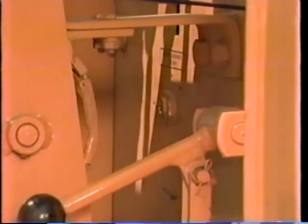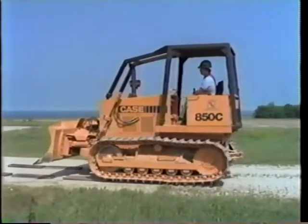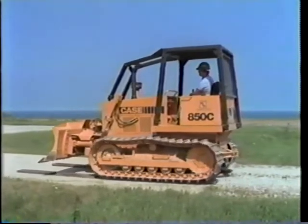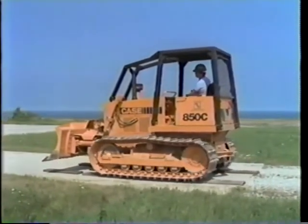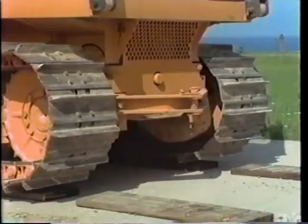Remove the key, then push the fuel shutoff control in. In freezing weather, clean the tracks and park on a hard surface or up on boards. This prevents a freeze-down, which could damage the transmission or final drive when you try to break loose.